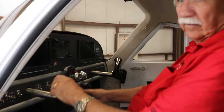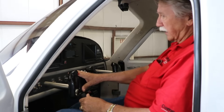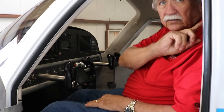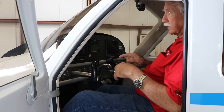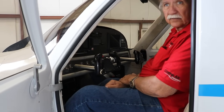The controls in the aircraft are conventional yokes and rudder pedals. The ailerons are run by cables through the fuselage — when it gets to the wing, it translates to a pushrod, so there are pushrods that run out the wing to the ailerons. The rudder is all cable to the rudder. The elevator is cable to the back and then picks up into a pushrod for control.